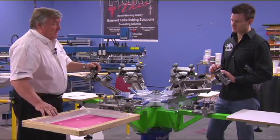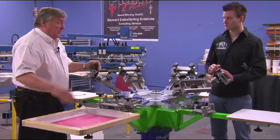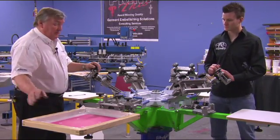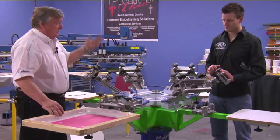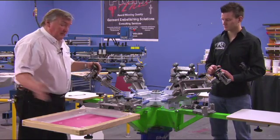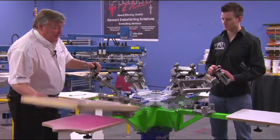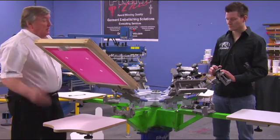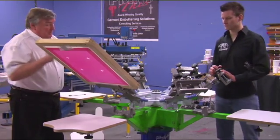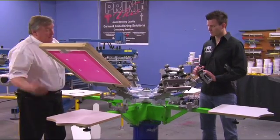I've gone way out of my way to make sure that no presses are obsoleted. Some of my original stuff from the early 70s — all the new accessories, jacket hold-downs, sleeve boards, any of that stuff — fits on the old presses as well as the new, primarily because this inch-and-a-half, two-and-a-half tube has always remained the same. And the basic geometry between all of this, I've tried to keep it common.